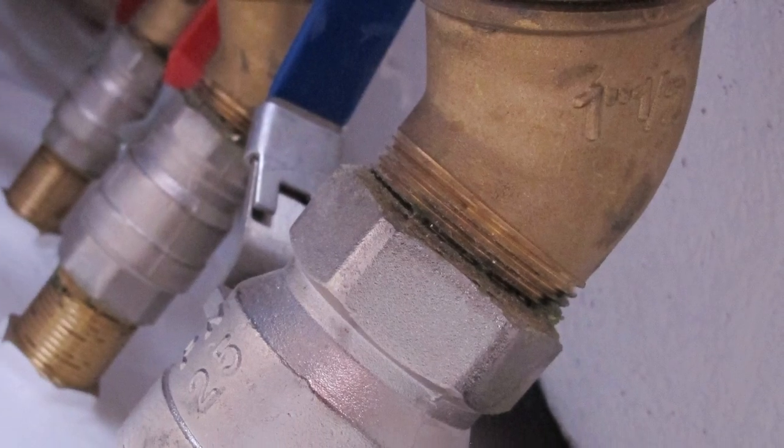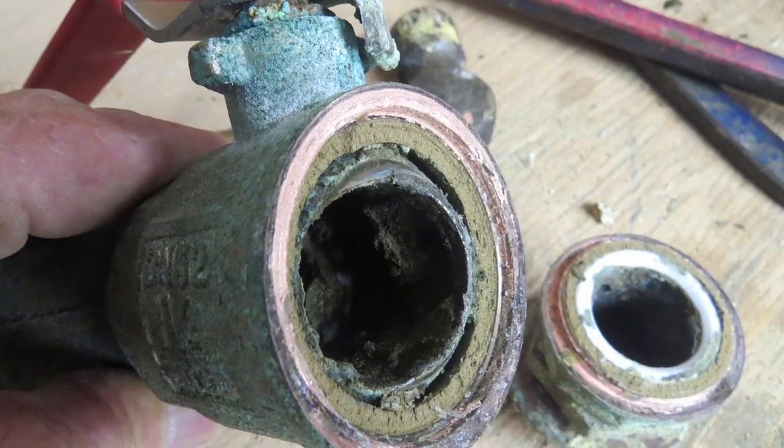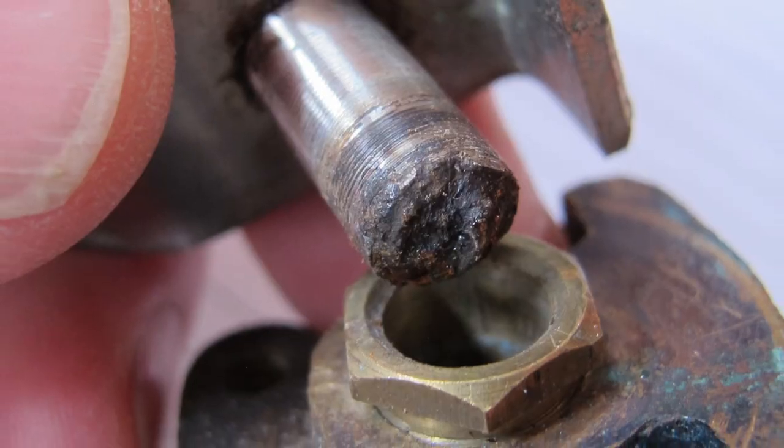With a seacock you can't see the through-hull because the piece is screwed into it, so you have no idea what that's made of. Then you see a tailpiece on there which very often is a different color, so you know it's a different metal — and that's already a bad idea to combine two metals in the same assembly. These are almost all ball valves, and you have no idea what the ball itself is made of — maybe another metal. I have lots of photographs of failed fittings, broken ball valves, and snapped-off handles.